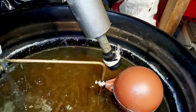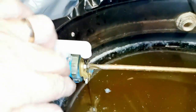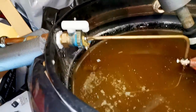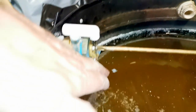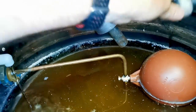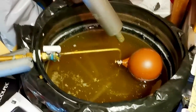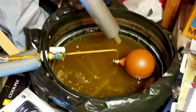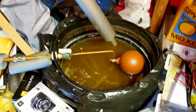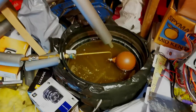If you've replaced the radiator, now is the best time to go and bleed that radiator whilst you've still got that bung in the tank. You can see the float valve has now virtually stopped flowing — it's just topping up the tank with just a little bit of water coming out. Now I can remove this bung or cap and I can be satisfied that no air would have been sucked into the system. You will just need to go around and check your radiators to make sure there is no air in them, but by following this method you'll get the least amount of air getting into your system and hopefully your system is back up and running again.